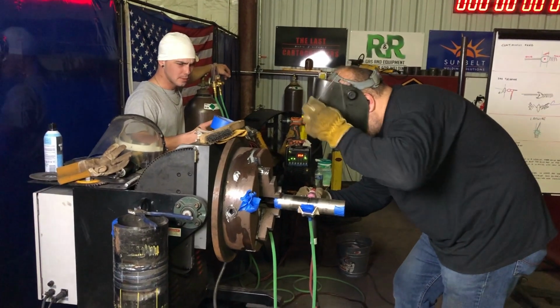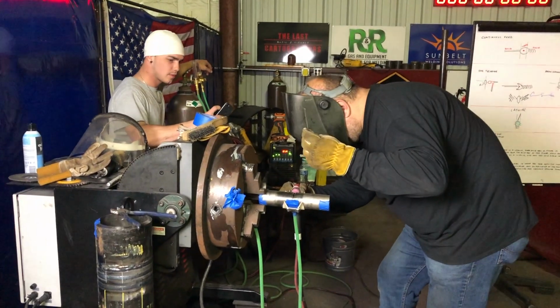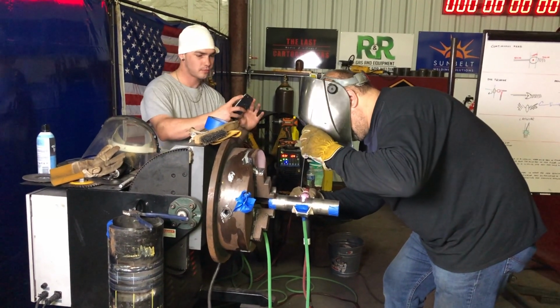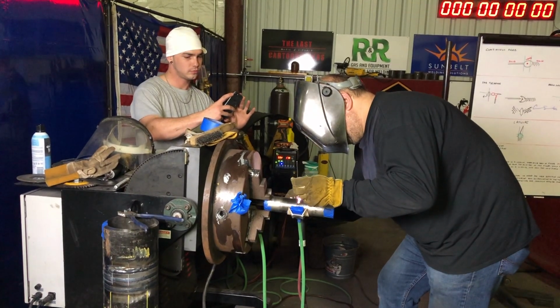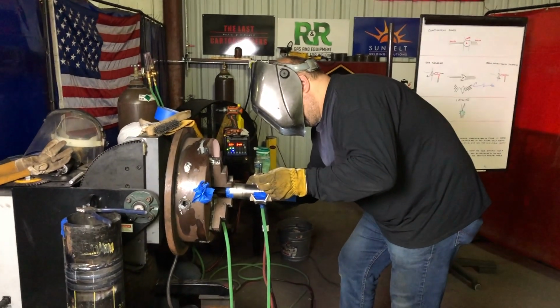So everything's gone? Yeah. So, fixed shade helmet, paying close attention. Trail shield has 2 separate argon hoses, one for the torch and then one just for the trail shield. Actually, this is a 3rd argon hose back purging the pipe on the inside.